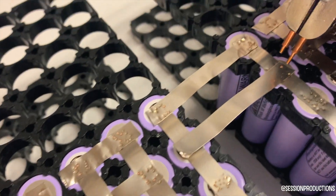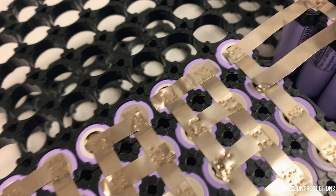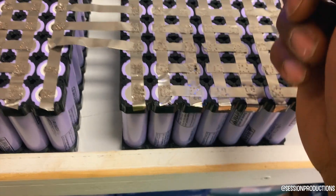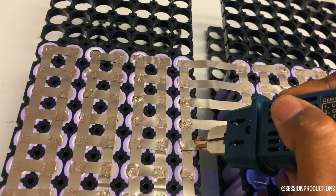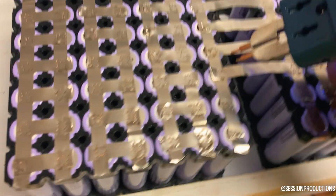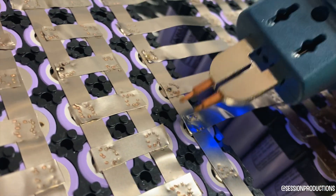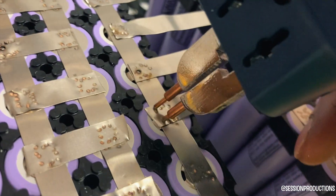This is the part where I bridge them. You need a little bit longer nickel strips so they can have a nice smooth bend, because you want them to bend all the way over without too much strip hanging off when it's done. All in all it's coming together really well, but this is my first time with this spot welder so I'm trying to get a good feel for it. Some spot welds needed a bunch of tacks and some only needed very few, but this pack is coming out pretty nice.